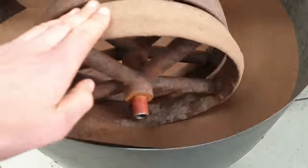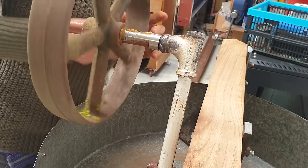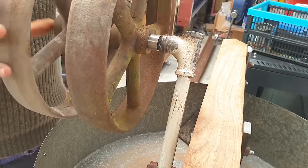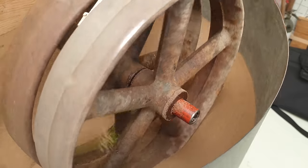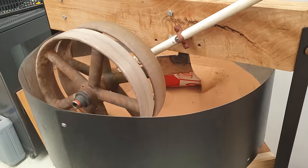As soon as I put water in the mix, it causes it to stick to the wheel, which isn't ideal, and only one wheel seems to be turning. So we solved this just by greasing up the wheels and then adding a layer of this slick plastic repair tape. That worked well and cut down on the noise somewhat, but the grease in combination with the fine sand made an excellent abrasive paste.